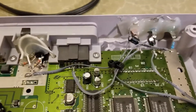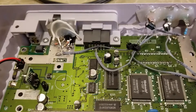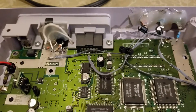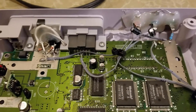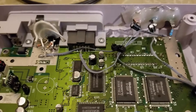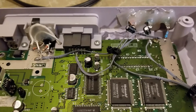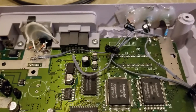If you get yourself a GPM01 or a GPM02 — and GPM02 is even better, which is what this board is, a 1993 Super Nintendo board, SNS-GPM02 — I highly recommend doing this component mod. If you don't have a set of HD Retrovision cables and you have even just the basic soldering skills, you won't need to seek them out. They can be pretty expensive when they're sold out.